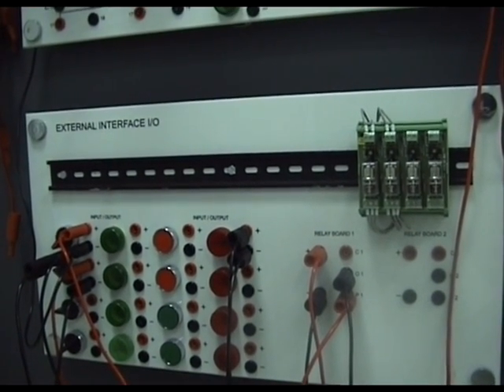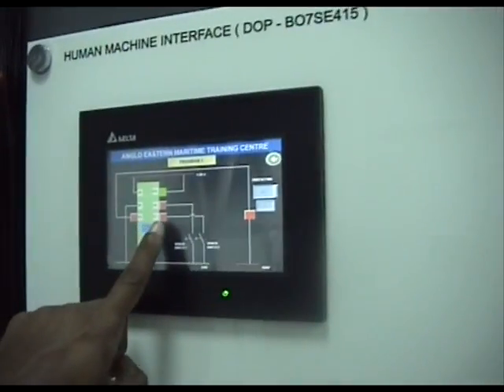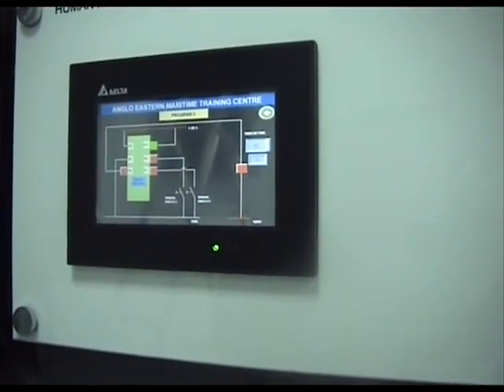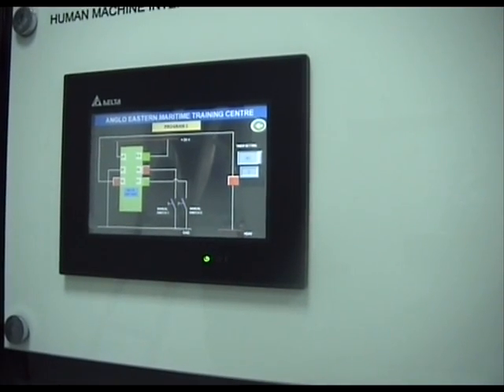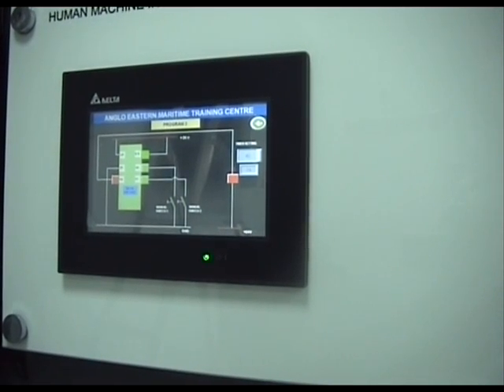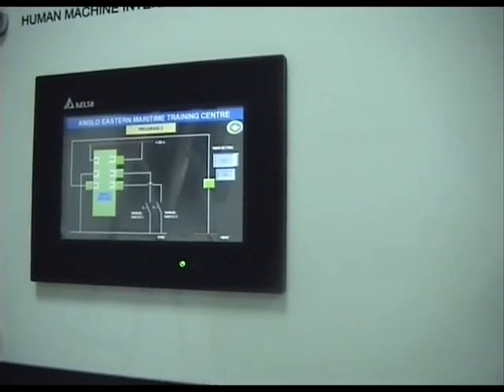While I do that, you can inspect the value and the presence of X0 and X1 signals here. I am putting the first switch on — that means X1 has come on. Now I will engage the second switch. The moment I engage the second switch, you can see that the timer has started to count down. The relay has come on, and my light has already come on.